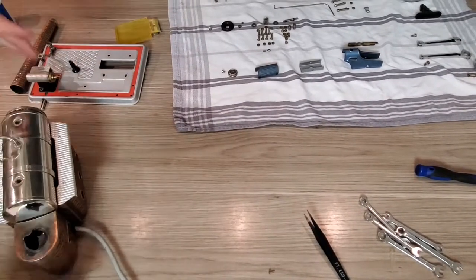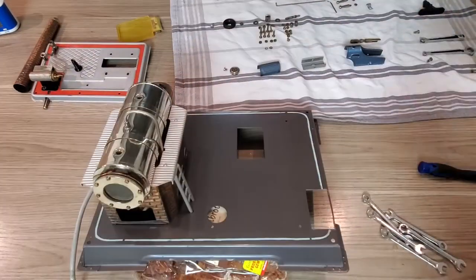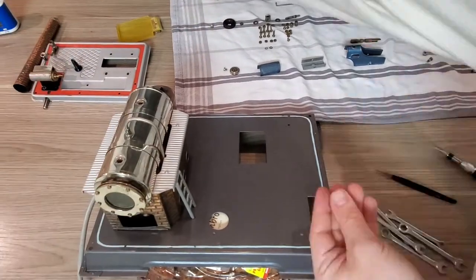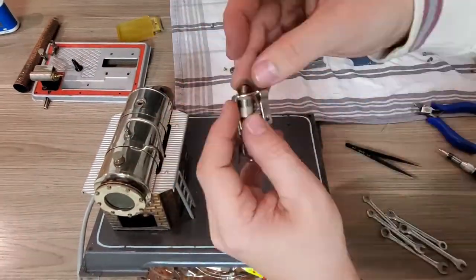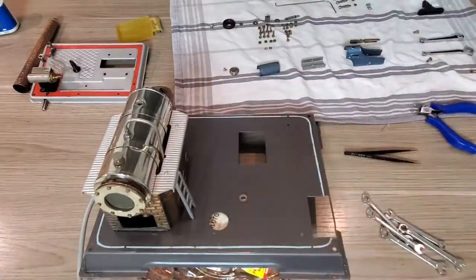Yeah, then after everything is done and set smoothly with everything in place, then the pipe comes in place. The pipe also comes, and also the release valve. There is a weight on it, and it is not spring loaded. The steam itself presses against the valve, and if the pressure gets high enough, then it lifts the weight.